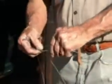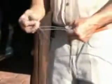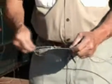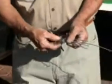Use a binding piece of a comfortable length which is bent while still on the coil. A shorter length from a different coil is bent to form a hook-like shape. When bent, the short leg of the hook should point towards you. The hook is then pushed through the loop of the binding wire and its short leg is bent inward to form a knot.